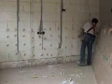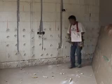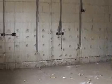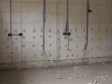Yeah, just finishing off the last little bit, just to give you an idea, about 1 bag of corner cement does approximately 30 to 40 square metres of sheeting. That's setting up 4 or 5 sheets 6 metres long. Now the sheet's just simply lifted across into position.